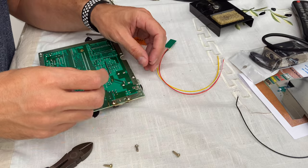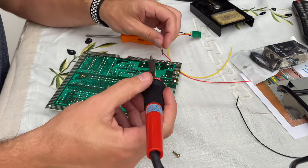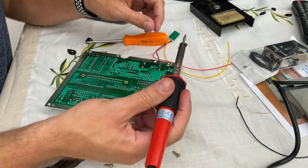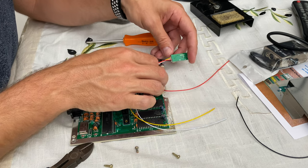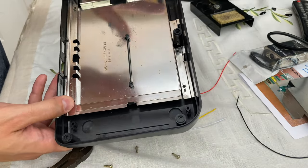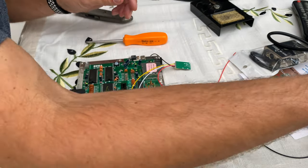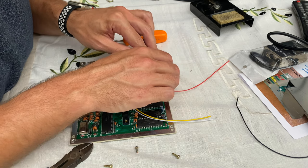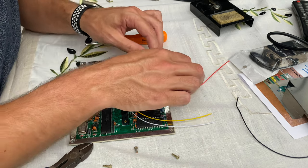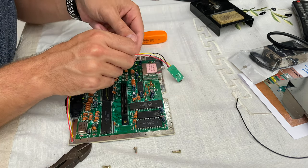So I'm just going to cut these cables down — it's recommended that the shorter you make these cables the better — and let's get the ground in place, the same as the modulator uses. I'm going to thread it round that way simply because when you reassemble the board there's a very hard sharp edge, and if the board goes on there there's a danger it might end up going through the wire. So it's better to come out over here, just a bit smoother, giving myself a little bit of leeway.